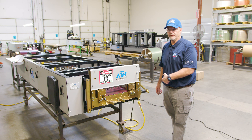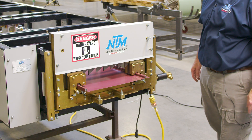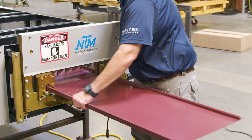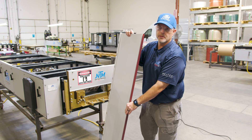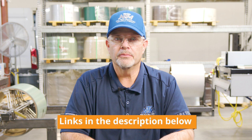At this point, remove the lockout/tagout again and bump the material forward just to make sure it doesn't snag on any of the shear dies. As you can see, no noise — we're good to go. Run this piece out all the way. This is where you would measure for your dimensions and check the straightness of the panel, then make any necessary adjustments. For further videos or instructions, check out our website at newtechmachinery.com or our YouTube channel. If you have further questions, call our service department. That concludes our changeover video for an SSR junior machine — thanks for watching, we'll see you in the next video.